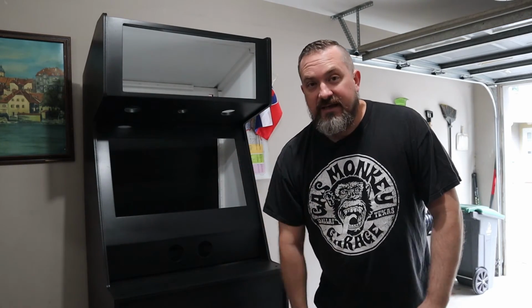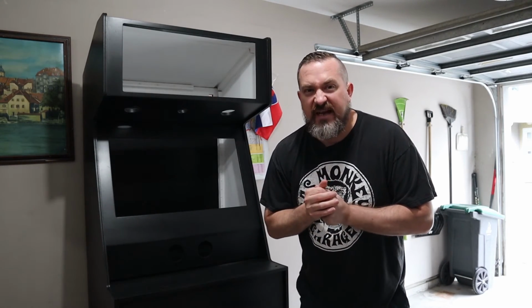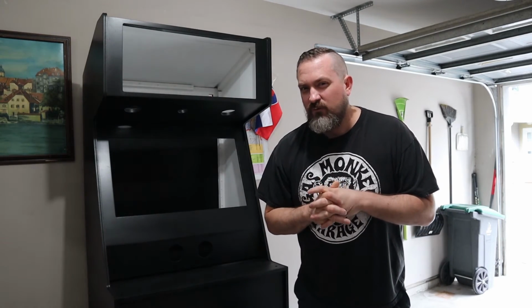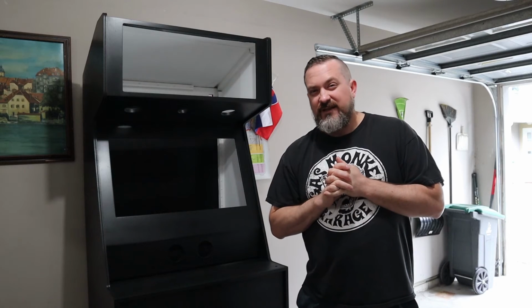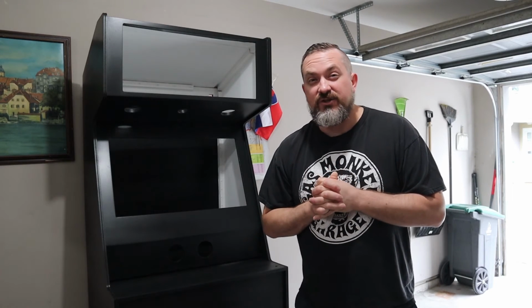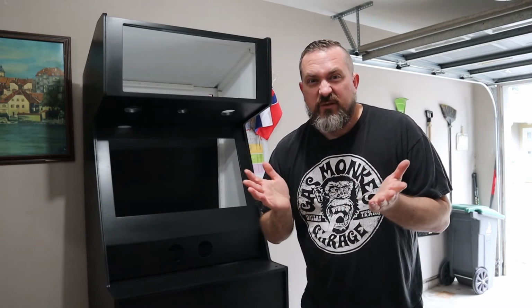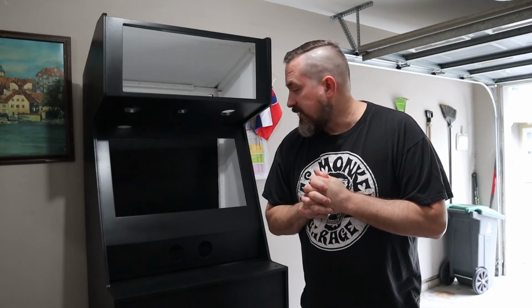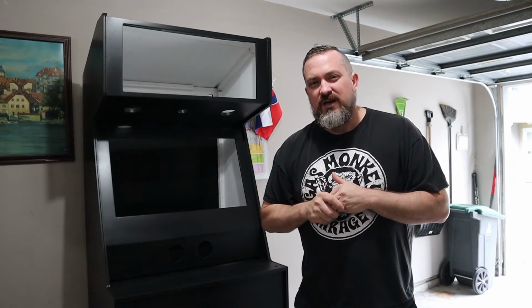And option number three is you find yourself a wax, like a furniture wax or a non-cleaning, non-additive automotive car wax, and that can protect the surface as well. It's more about protecting it from water. It's not as durable a finish as a clear coat, but it is an option, and if you find that your paint is not as shiny or as nice as you'd like, the wax is a good option. Basically apply it with a cloth, and then you can even buff it up to the sheen you want. The only thing is, you have to reapply it, maybe every year or every couple of years, and rebuff it, but definitely not bad. Probably not great if you're thinking down the road about putting any graphics on top of the wax. You'd have to really remove that stuff, but that is an option.